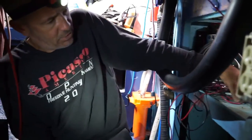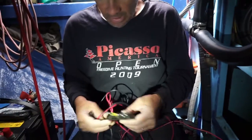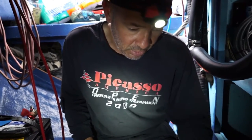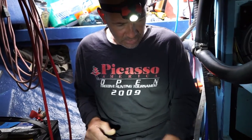I found these two wires here — these run to a terminal strip. This was for the shallow bilge pump forward and our bigger high-water bilge. Those came straight off, and that's what that fuse is for.